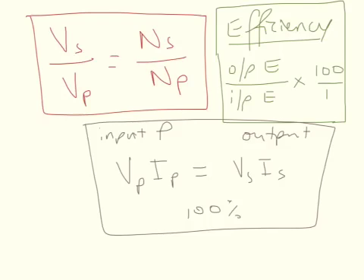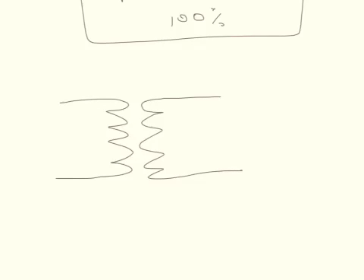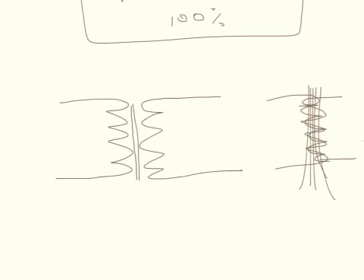Those are some very important equations. Now I want to quickly look at how transformers are made. They usually have two coils — that's the symbol for a transformer. The coils are usually quite close together, sometimes on top of each other, so you could have a winding here and a winding here, and that's the most efficient way to share those magnetic field lines. You can stick your iron core in there as well. If you have an iron core in the symbol, they'll draw a line or two. That's your electrical symbol for a transformer in a circuit.